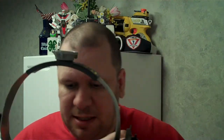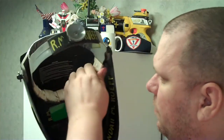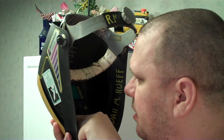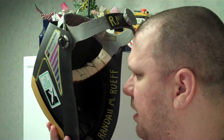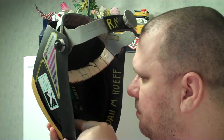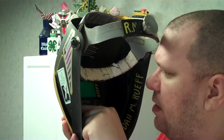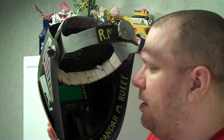It's a Speedglass helmet — not the newest model. For those of you keeping track, it's the Speedglass 9000V. For stick and MIG and TIG welding, it's got shades 9, 10, 11, 12, and 13. And then at the bottom it has another setting for TIG at shades 9, 11, and 13, but the sensitivity is adjustable. Whereas on the top shades — 9, 10, 11, 12, 13 — for SMAW, GMAW, and GTAW, it's automatic.